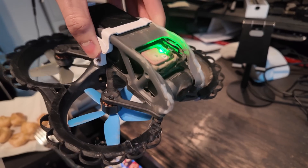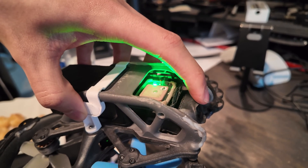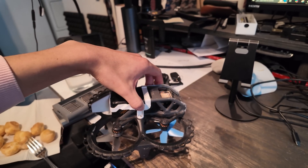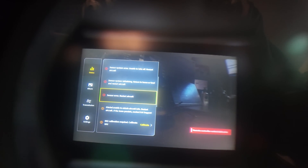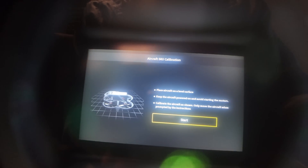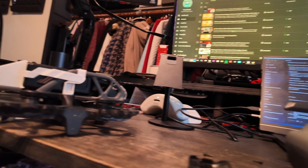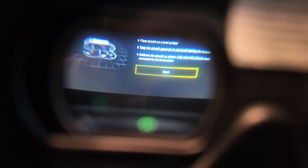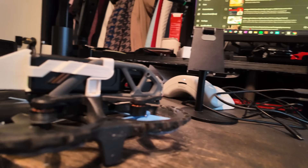And another thing — the camera, the gimbal doesn't work. Typically it will move and adjust. It's not doing that. I think that might be because the GPS positioning is messed up, so the aircraft doesn't really know where it is in space. If you look in the headset with me, we got a ton of errors — just errors after errors. There's one that says to calibrate the IMU. I'll go to calibrate and press start, but the aircraft is just going to long beep. Pressing it and it just goes back to the screen. It used to beep the aircraft, now it's not even doing that. It's beeping — I think it beeps the headset, but maybe it can't communicate to the aircraft. So that's the reason why I'm going to try to take apart the GPS module. I haven't really seen any other videos on how to take this GPS module apart, so we're going to do that today, right now.